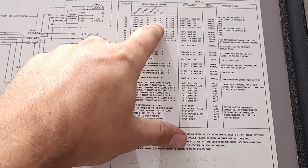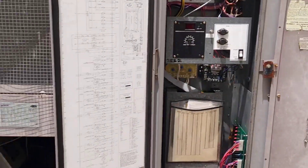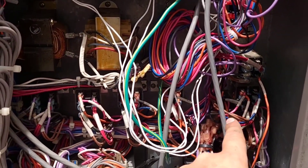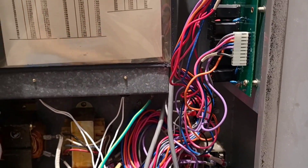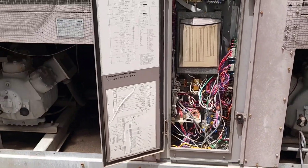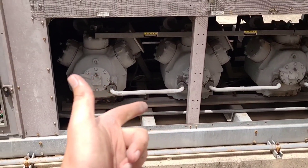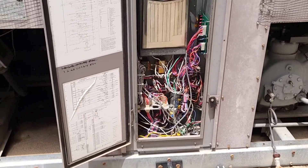Compressor 53 is showing a compressor failure on high pressure switch. Something I've had issues with here — the condenser fans are common to fail, and also the relays in this panel will trip on high pressure, but the problem will actually be these little relays as the main issue. I'm going to go up and check the fans, make sure all the fans are online, then I'll reset the alarms and make sure the head pressure looks okay with the alarms cleared. If the fans are all running and we're not actually having a high pressure issue, I'm going to condemn these relays and we'll come in and replace them — that will eliminate our alarm problem.